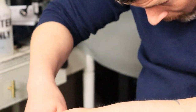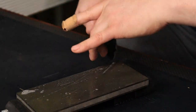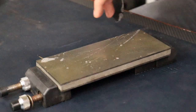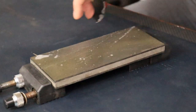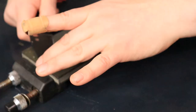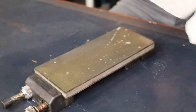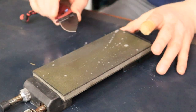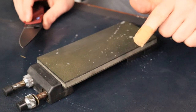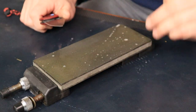Your first stone should always be your reprofiling stone — always start with a coarse to extra-coarse stone, then move to a medium grit stone. I'm ending on a medium grit stone, around 600 grit, because that is a great edge finish. In this video I don't want to go to a polish because if you can't do this part, you'll never be able to do a polished edge. This is the most important part of sharpening: learning how to use the coarse stone and the medium grit stone.